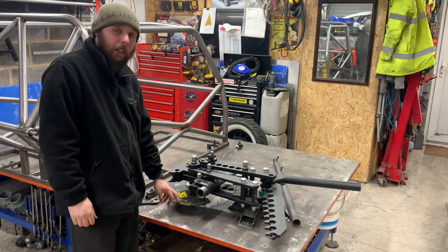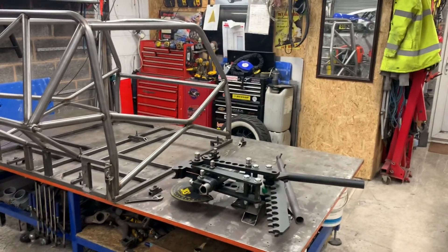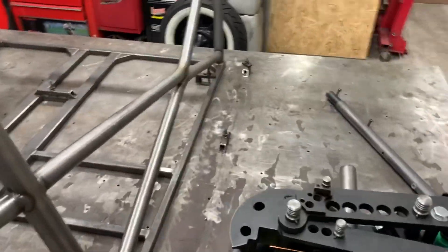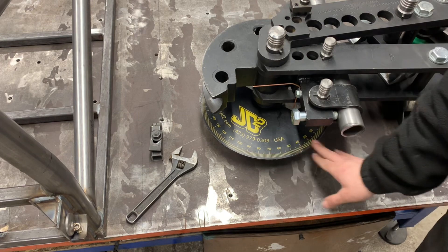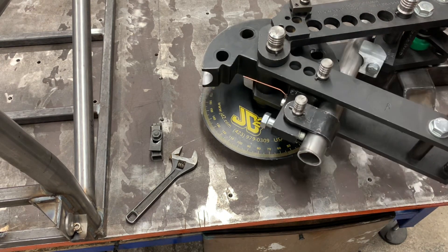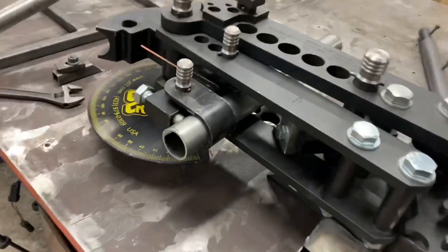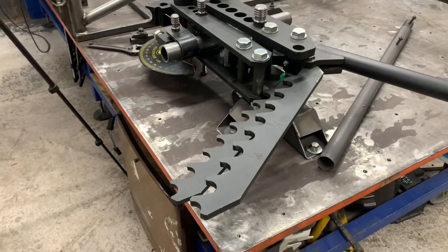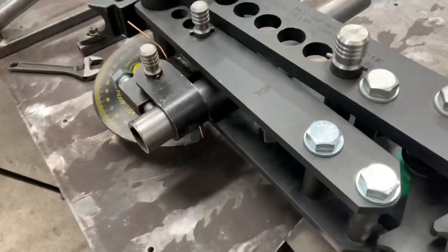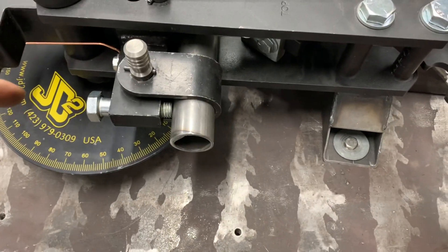The degree ring on here - normally you'll have it there, but watch, I'll show you. See the grey ring? Normally you have your zero here and your pointer sticking out, but what I've done is moved it - the trick is when you are on your own you need it there so you can see it when you're pulling it round. That's the easiest way I find of using it, because when you're on your own you can't look down here when you're pulling over there.